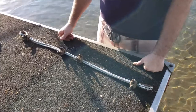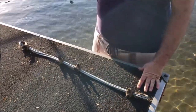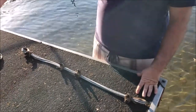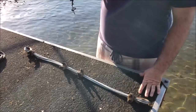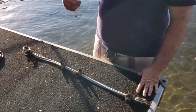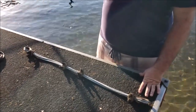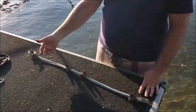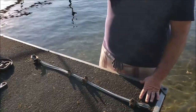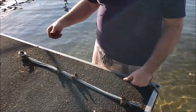What we'll do to get it out is go out there with a come-along and a hook in our eye bolt under the swim raft. We'll swim down and hook the chain close to the weights at the bottom, pull those up, and chain those weights to the bottom of the raft. Then we'll go down and get the buried primary set, winch those out of the sand, hook them to the bottom of the swim raft, and drag the whole thing in here to rebuild the weights.